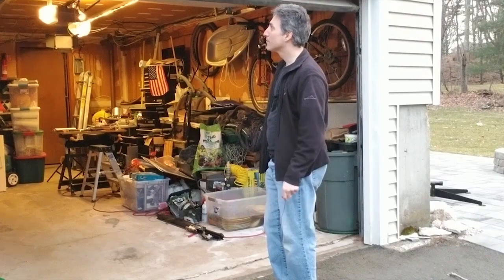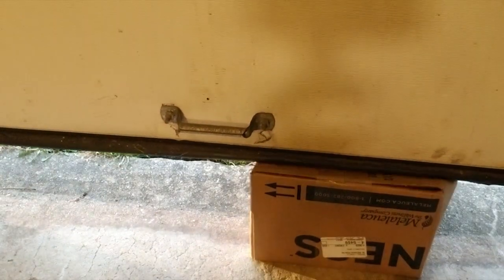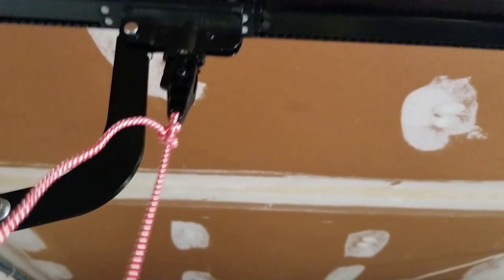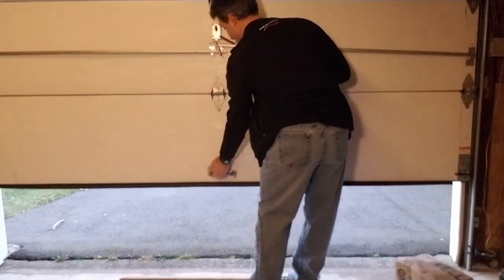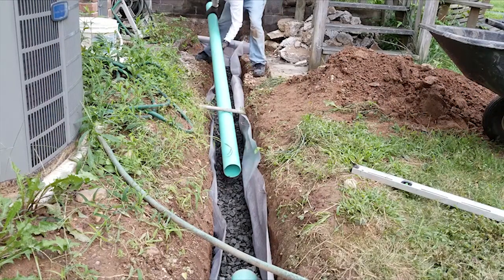Hey everyone, welcome back to my channel. In the first part of the garage door opener saga, I found that during safety feature testing the reverse force detection was marginal, and the target of reversing when closing on a 2x4 was not being achieved. After consulting the installation manual again and measuring the door weight per the instructions, I found that the springs were no longer sufficiently supporting the weight of the door. I suspect the main reason for the 2x4 test failure is an unevenness in the garage door slab due to cracking and settling from previous water issues around the house. You can see my water wars video series for more on that.